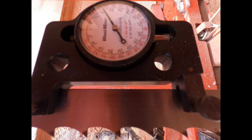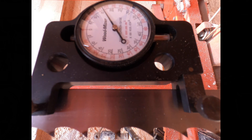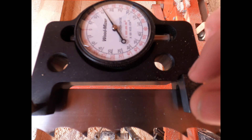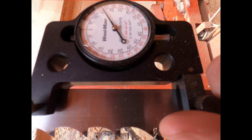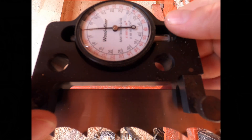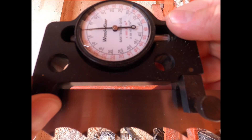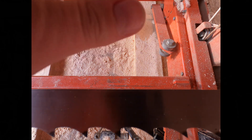We're still at zero, so I'm going to put a little bit more tension into the blade and hopefully hit 25. We're about 22 right now — that'll be perfect for what we're doing. That's how you run it. The last thing to remember is whenever you take this blade guide off, take off your movable leg first. That way it doesn't shock your indicator when you're trying to take off the entire assembly. Loosen your static leg and it slips right off like that. Catch you on the next one, guys. Thank you.